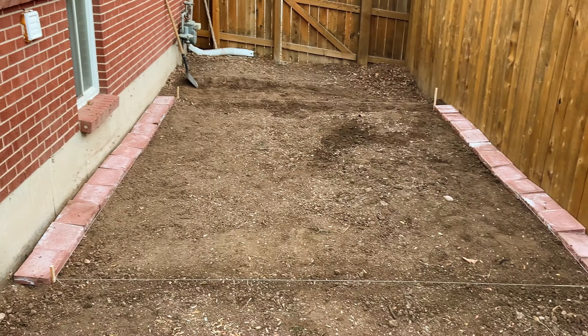I've got the sheathing on the back wall — all nice and even with a four-inch gap all the way across and a one-inch overhang on the side. This stuff here is called Z-flashing — it keeps a watertight gap between two butted ends. Before I put it on though, I'm going to measure the sheathing and keep a half-inch gap at the top for when I do the rafters. So since this section is four inches, I need to make three-and-a-half-inch strips that are four feet long.